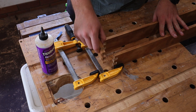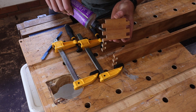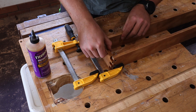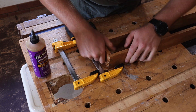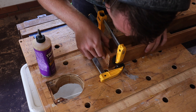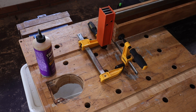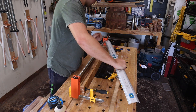As you may know from that side table video, regular PVA glues like Titebond can make life really hard for already snug joints, so polyurethane glue will be my hero here. As you can see they slip together perfectly and clamp up like a dream. Once clamped I use my really long ruler to check for square.